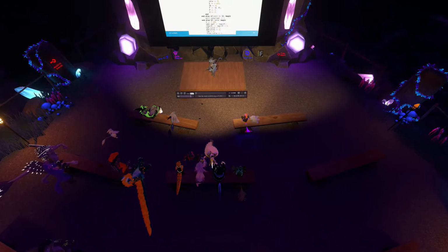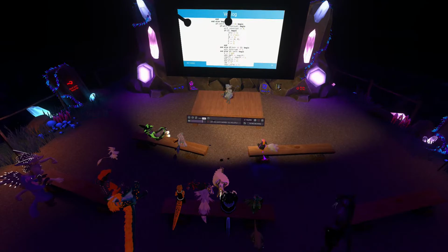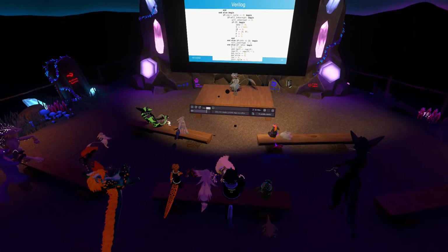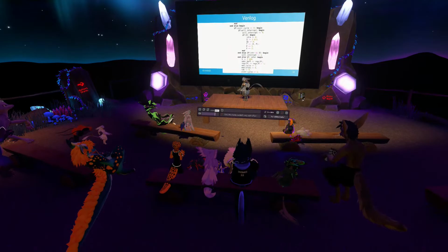This is the one that's used by SkyWater. It's Verilog. It looks like C, right? It looks kind of like C with some different syntax. You don't have curly braces, you have begin and end. And the assignments are arrows instead of just equal signs, but it looks almost like C, but it's not C. In fact, this is not a software programming language. You cannot compile this into software. Instead, this is code that will compile into physical hardware circuits using a tool called a synthesizer.